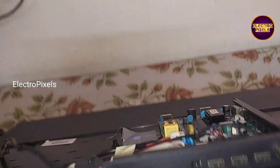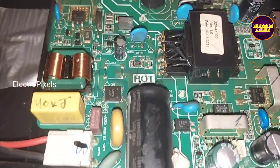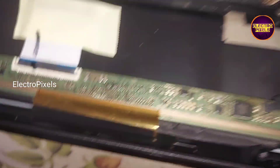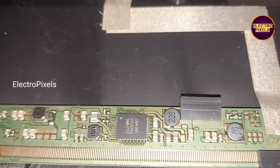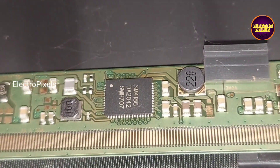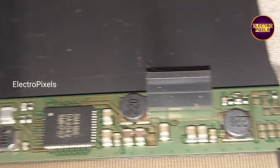Mainly these types of complaints are due to internal shorting in gate signals inside the glass panel. This TV comes with a single COF Samsung panel with SM4186 DC-DC IC. Due to internal shorting in gate signals, this particular SM4186 DCIC goes into protection mode, and because of that it doesn't generate any basic panel voltages like VGH, VGL, etc. For repairing this panel we need to remove the panel shorting.